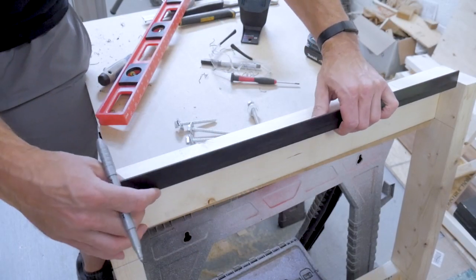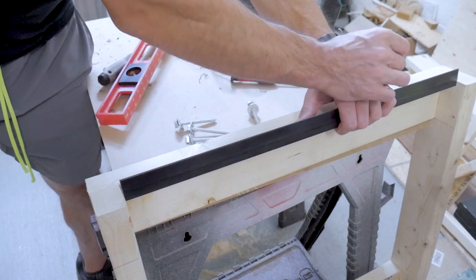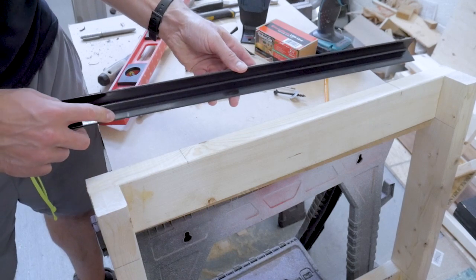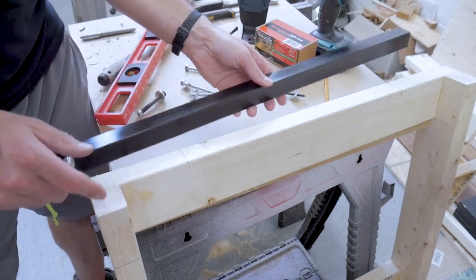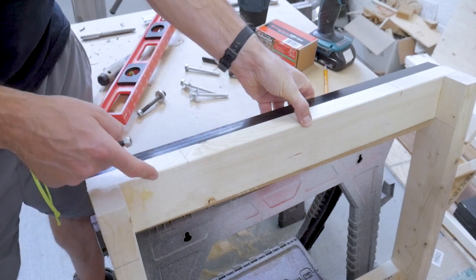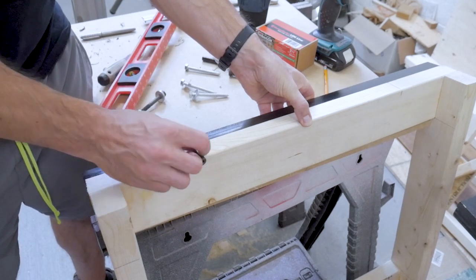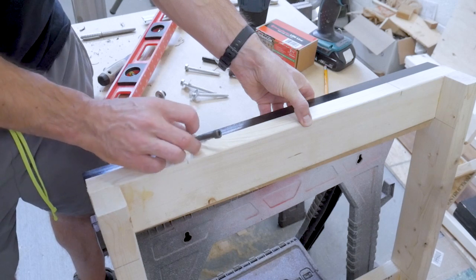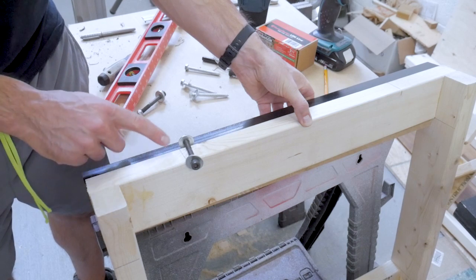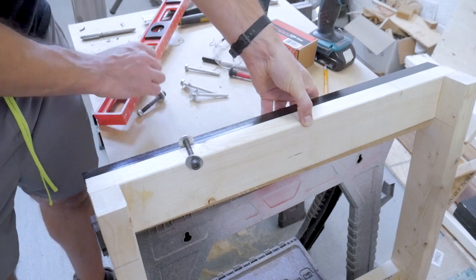The reason for doing this is that I'm going to transfer these marks over to the angle iron so I can drill the clearance holes on my drill press — both for the structural screws I'm going to use to mount this frame to the joists and for some M8 hardware. What I'm going to do is take the two pieces of angle iron that go on both sides of the stationary frame, slip an M8 bolt right through them and through the wooden frame itself, and it's going to actually sandwich the whole thing together and solidify it as one solid piece.